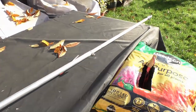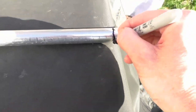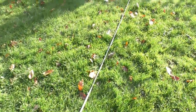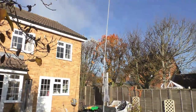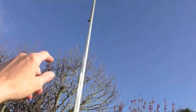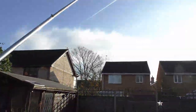It's been outside a few years now. What I'm going to do is pretty much the same as with the mobile antenna — put a few reference marks along the length of the antenna with a Sharpie, which will help when it comes to adjusting the SWR. The Silver Rod is made up of tubular aluminium sections held together with jubilee clips. Fully extended it's just over 18 foot in length. On a short pole, two metres off the ground, it's high enough that it won't affect the SWR. When adjusting it, rather than using a stepladder, my preferred method is to simply tilt the antenna over on this heavy cast iron base stand so I can get to the first jubilee clip and slide the antenna up and down.